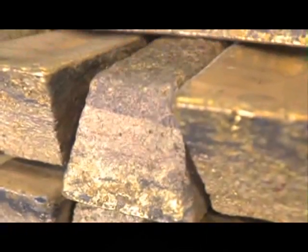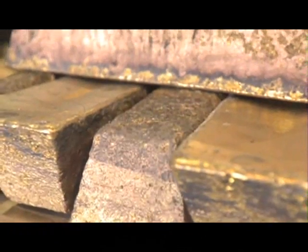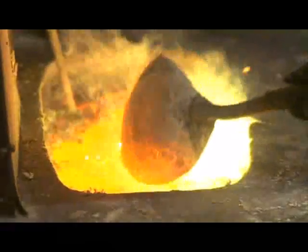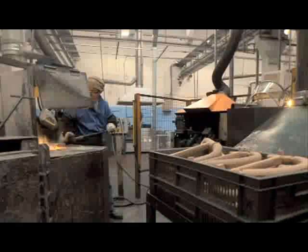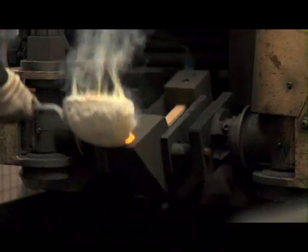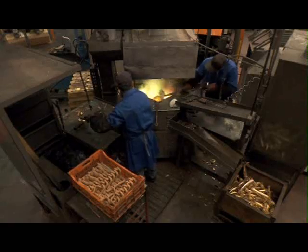Manufacturing begins in our foundry with pure brass and environmentally friendly low-lead alloys, heated to 1000 Celsius. It's now that the tap starts to take shape, when the molten brass is poured by hand over a refined sand resin mix into the cast iron mould. But the tap is far from finished.